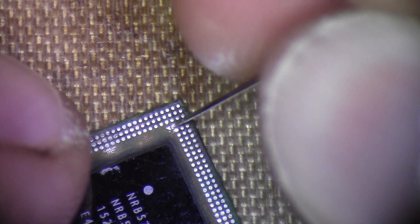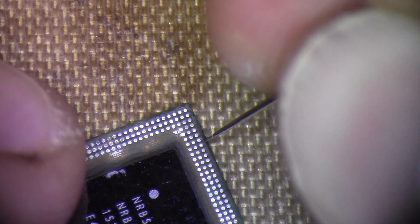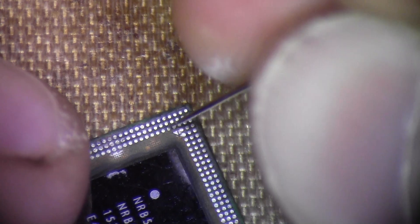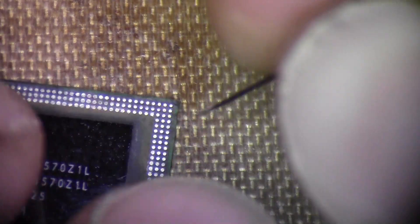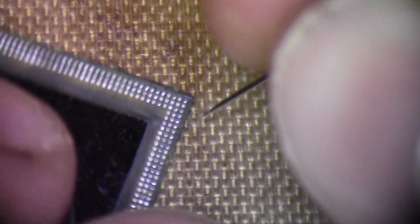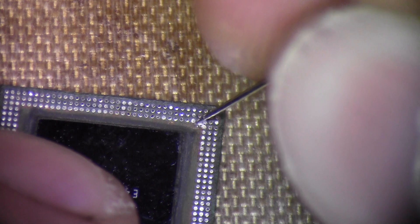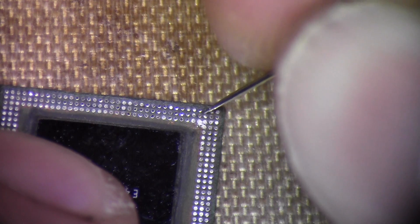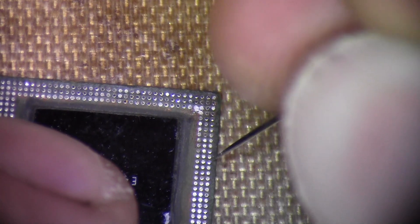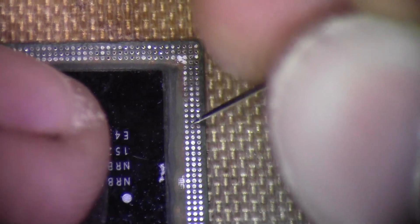The pads look pretty good. Right here some of the mask came off, but all of this is ground — all the way over to here. There are two pads there that are not ground, and a couple of pads here that are not ground, but all this right here in the corner is ground. This whole area here is ground plane. From this pad over, that pad and that pad — all this right here is also ground plane. These pads here didn't turn out too good, but it doesn't matter if those go short since this is ground plane. So this all turned out good.